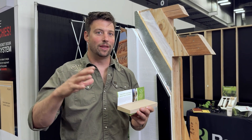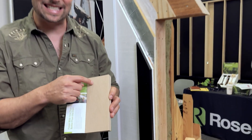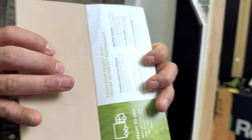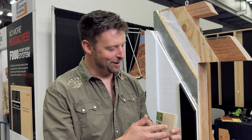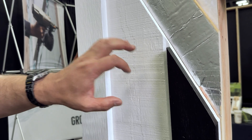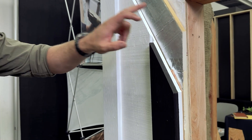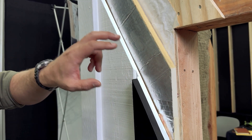Armorite is an exterior trim — exterior and interior — and it's fully waterproof with a 50-year warranty, which is wild. It is an exterior MDF. If you've ever worked with interior MDF you know that if it gets wet it just goes to pieces — it's not a water-resistant material. Don't confuse interior MDF with an exterior MDF like this. This is engineered wood meant to be outside. What I like about it is it's got a sanded surface — one side more aggressively sanded and one more fine — so you don't have that fake wood embossing that some non-wood companies love to put on theirs.